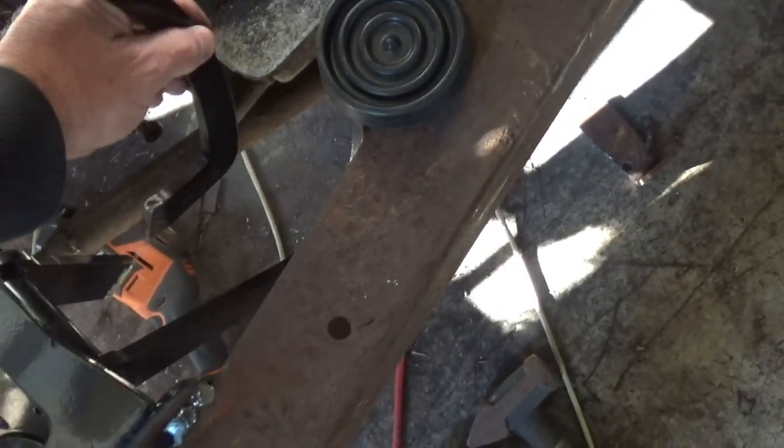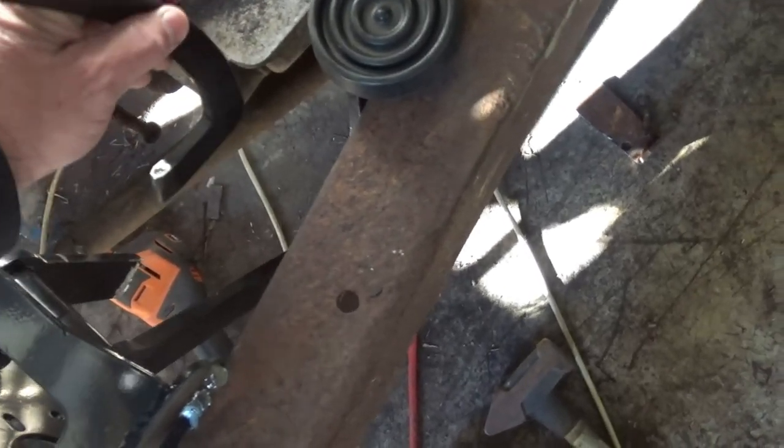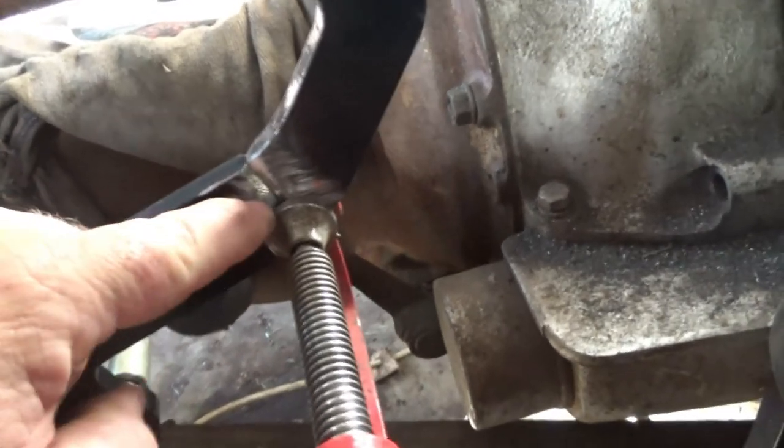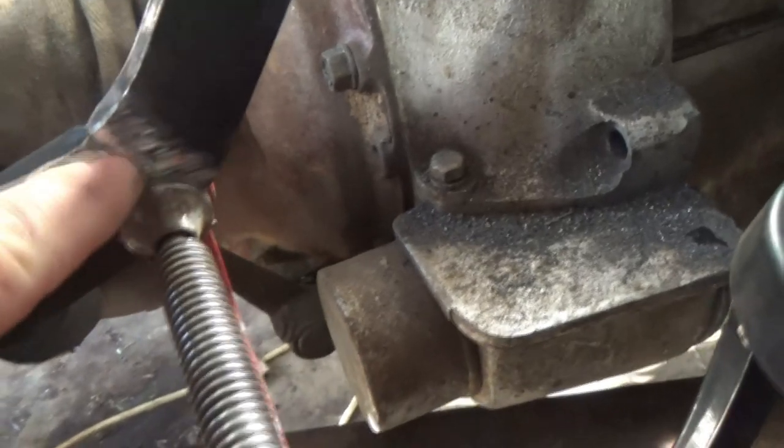I'll shorten both pedals so we've got full range of movement in there. Let's fire up the welder. We'll stick that on and we're nearly ready to strip this whole thing down, flip it upside down and weld everything underneath. Now there's nothing wrong with doing a weld on something like this — just make sure you've got really good penetration and giving it a nice V where the weld's going to be is going to assist with some decent stickage.